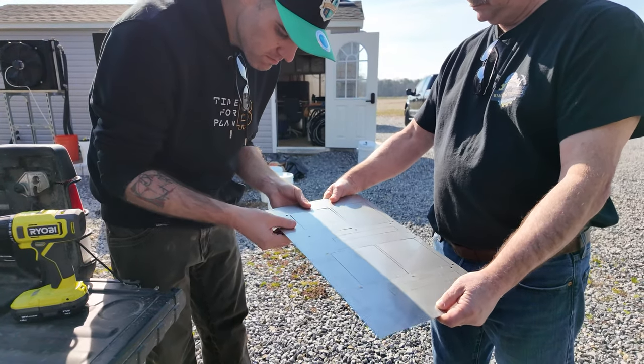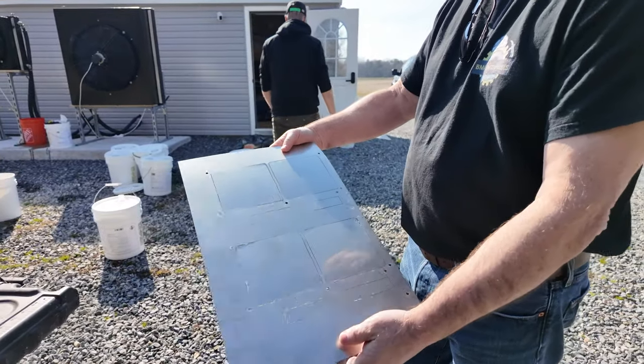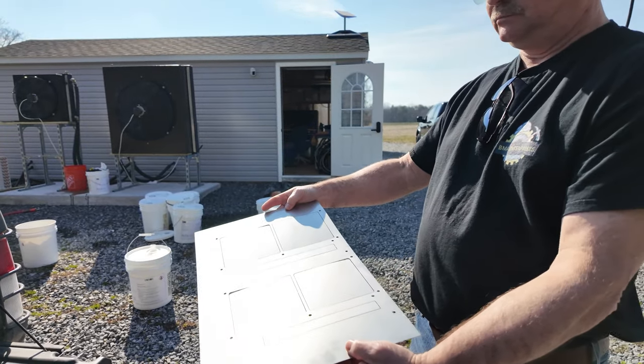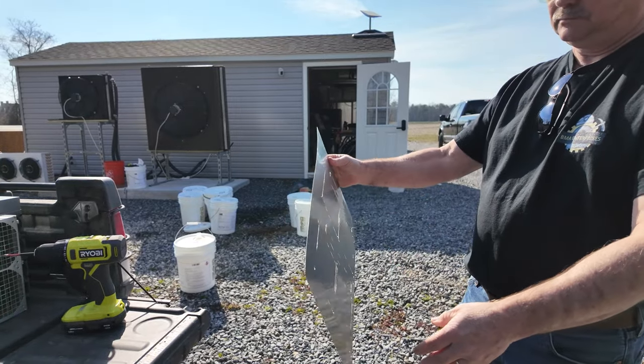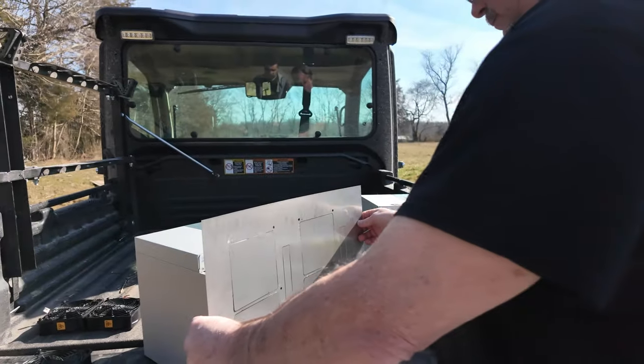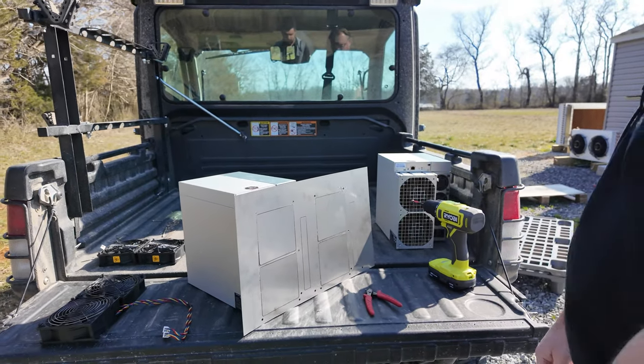So these are the back plates for your miners inside the DCX Bitpod. The function of them is to direct the immersion fluid through the miners, basically so your fluid is providing maximum cooling capabilities instead of just flowing around your miners. You need it going through it, and specifically you're targeting the hash board and the power supply. So, Dennis, what are your initial thoughts on the DCX Bitpod? Nice, cute little two miner immersion tank. It'll be interesting to see how well it operates once we put the miners in and get them started. All right.